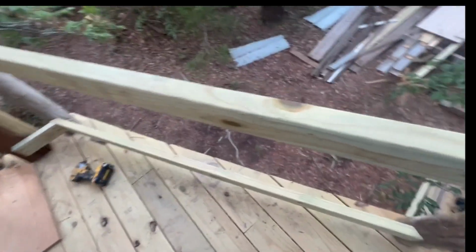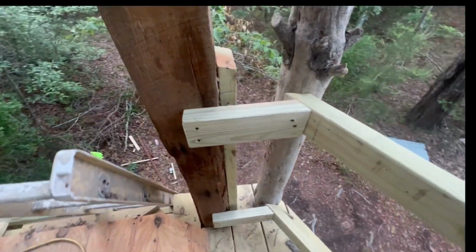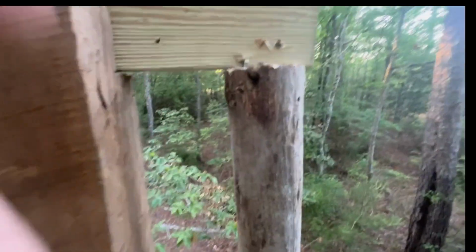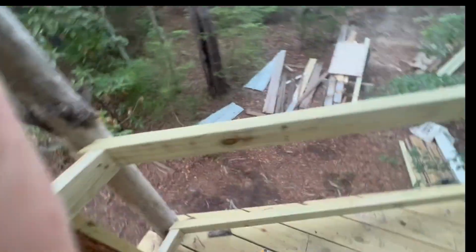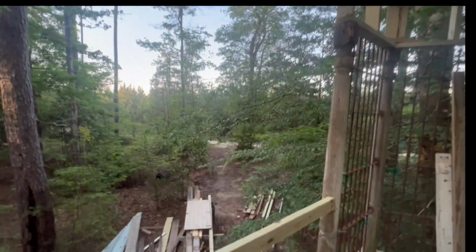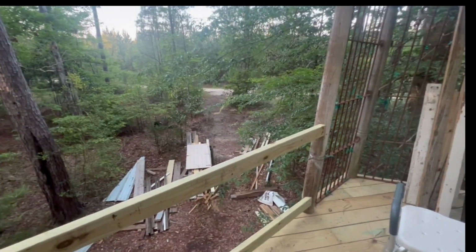Okay, the 2x4s are done, and they're pretty straight considering what I had to work with. I got the corner returns, and this will obviously continue one day. I didn't have a whole lot of meat up here. I'm going to put in another 2x6 so I can fasten the top a little better. But that's all good, and now I got to fit my post back. It's not going to go back where it was. It may end up going on the outside of that rafter, which is not my preferred, but better than having no posts. Let's see what it'll do.